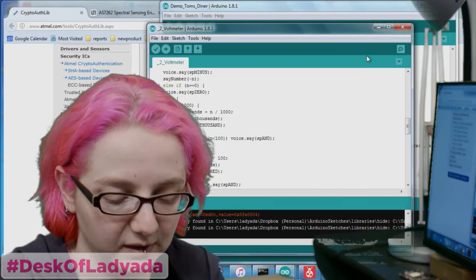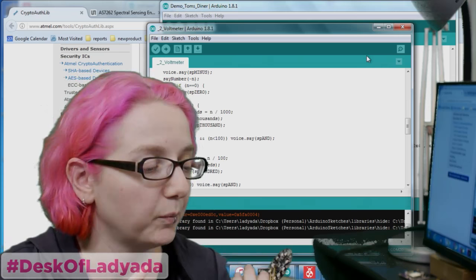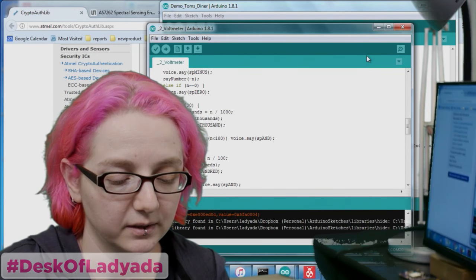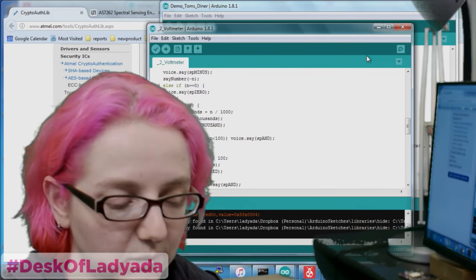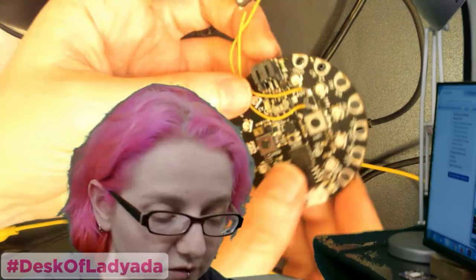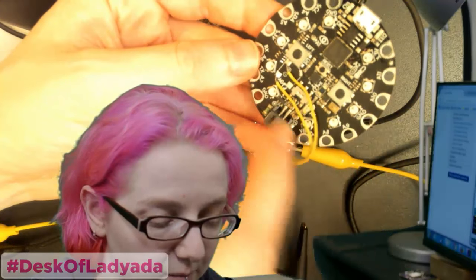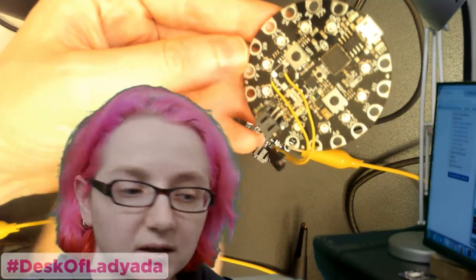The reason I was doing this is because I wanted to get the Circuit Playground Express, which has an analog output connected to the speaker — I wanted that to play the little speaker. Can we go to the overhead? I'll show this really fast. So the new version of Circuit Playground — I didn't have the exact same speaker size so I just wired this up. I switched the transistor for a little Class D amplifier. I'll get really close.